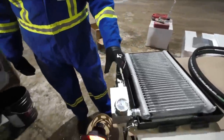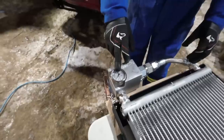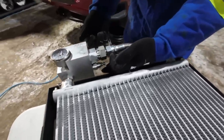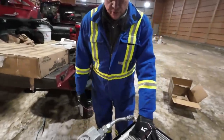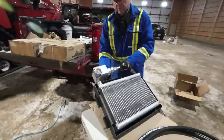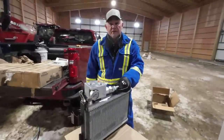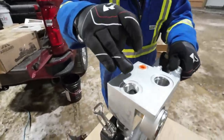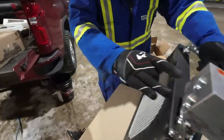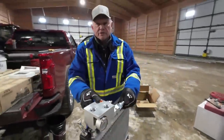This is the blockage prevention control block. It has a gauge that indicates pressure coming through the unit. Down under here are the relief valves — the 750 and 850 PSI — plus the radiator, which is rated for 2,400 PSI burst pressure. That's why I can't just go find one at some hardware store. It has pressure and return inputs from the cart, and on the back side, pressure and return going to the fan, and then this part with the orange cap is our case drain connection.